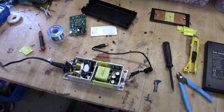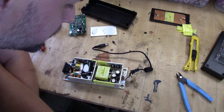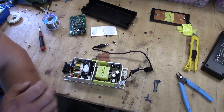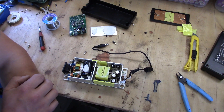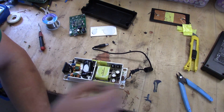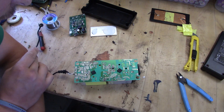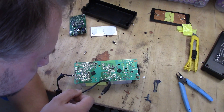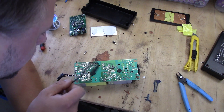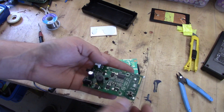So I'm guessing there's something else wrong with it. Basically this unit is scrapped — I don't have the competence to do any more fault-finding here. I'd need to pick it apart to find the faulty components. I'm guessing it could be some of the switching transistors or even the circuitry here. It looks a little brown — that component there seems burned as well.